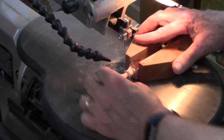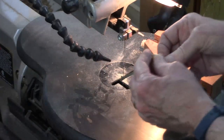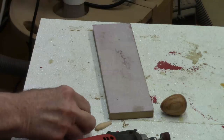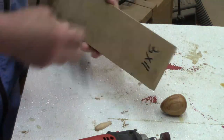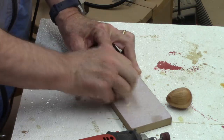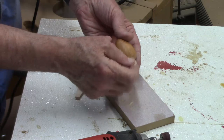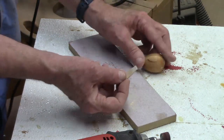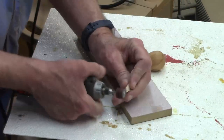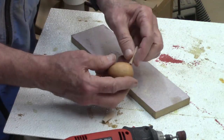That's almost smooth enough. I can rub that against some flat sandpaper and I'll show you the tricky part. A couple of quick sanding tips — put a piece of 120-grit on a piece of maybe three by eleven MDF, and that may be all you need. You're going to glue the ears here, and you want it slightly concave to match the convex profile of the ear. You can wrap sandpaper around a dowel, or in this case I'm just going to use a Dremel-style rotary tool. I'm going to drill a tiny little hole here and a matching tiny little hole in the ear for a toothpick to help support it during the glue-up.